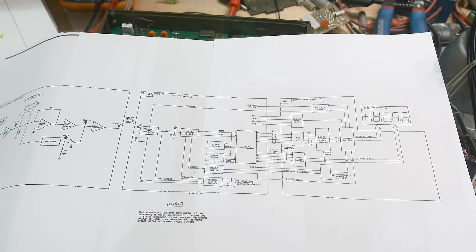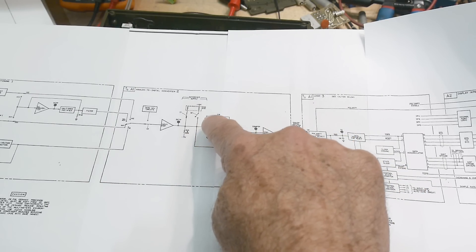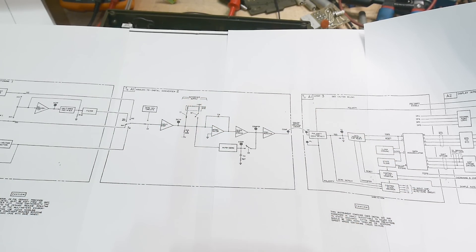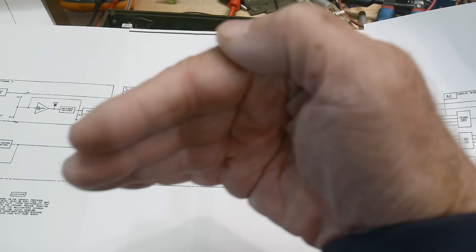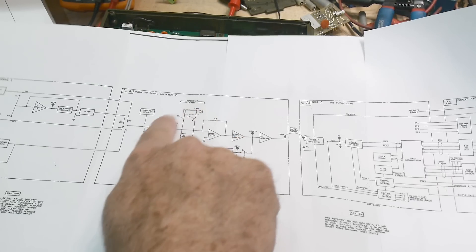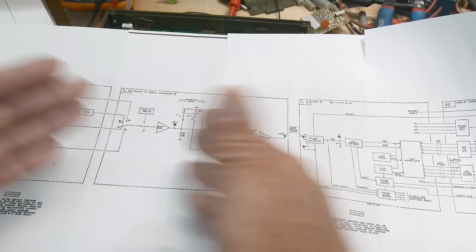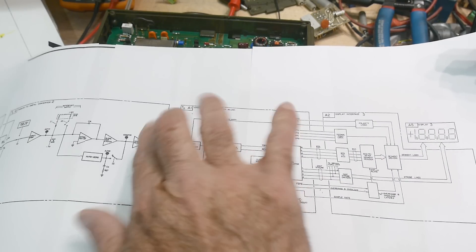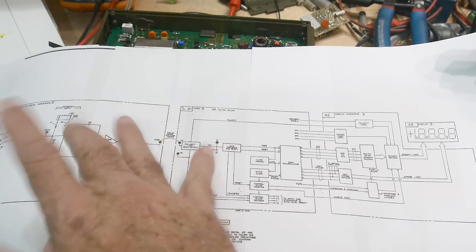Those two magic pulses come out of a comparator. It's a dual-slope integrator: you integrate up, then integrate down, and the comparator fires on the way up and on the way down. One slope is fixed - set with a 10-volt reference - and the other slope corresponds to the input voltage. The two slopes will be different, the length of time will differ, and that gets displayed as voltage on the output. With the jumper in place, this section runs separately and seems to be working fine.